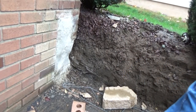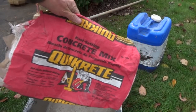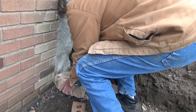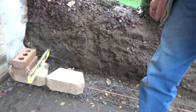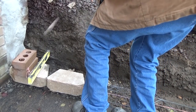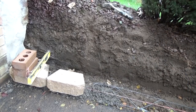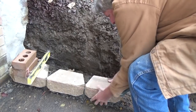I'm going to put a little fast-drying cement under here — this is what I use to mix for the bottom. I get my block. See this lip on here? I'll explain that. I don't want it on the bottom course, so I get the hammer and knock it off. Put a little bit of cement down there, right even with that line. I want it back just a little bit.